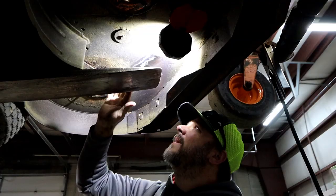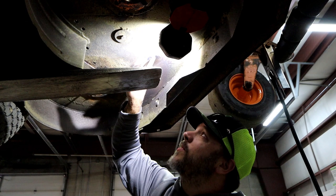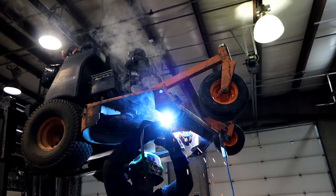So that one over there is actually a crack with light showing through it. This one right here is just a small stress fracture — it's there, but while we're under here welding we went ahead and cleaned it up. We're just going to run a short, clean little bead across it and it should be good to go.